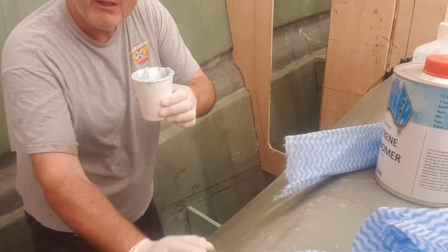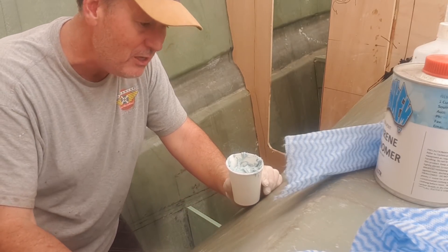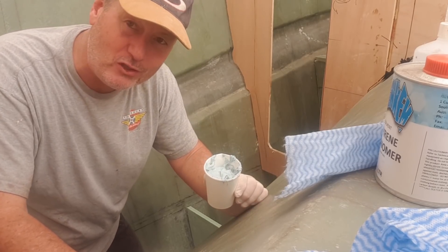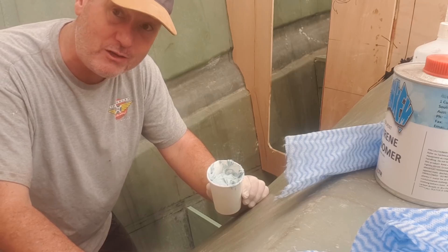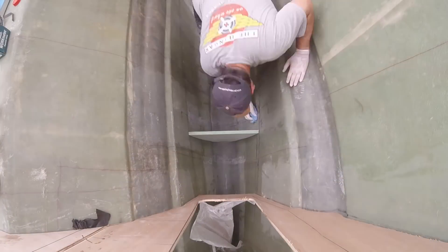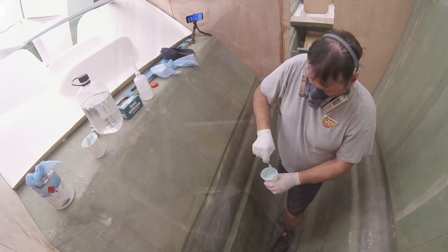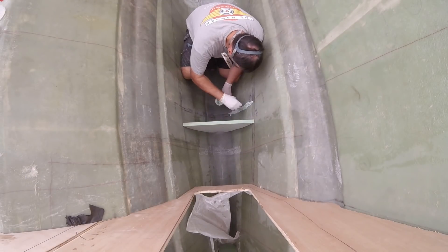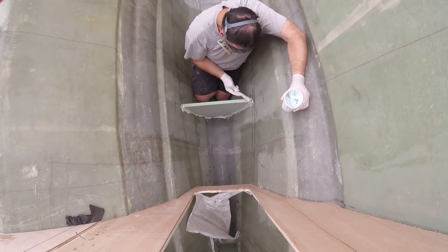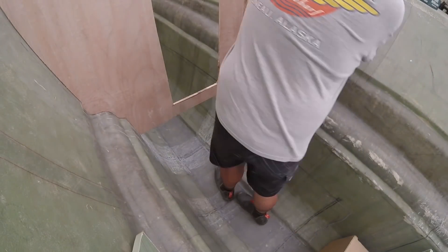I pre-mix up the filler — the adhesive, which is the ProBond light. It's brilliant stuff to work with; the issue is you've got about 10 minutes of working time, so you've got to get into it and clean it up as quick as possible. The beauty is it sands quite well — like a fairing paste — so as long as you get in and sand it within a couple of hours of laying it, you've got a good surface to work with. I have to say, it's been one of the more rewarding parts of this build — putting these bulkheads in — because it actually determines the structure of the boat. It's something physical you can see. Even though I'd cut them and put them in place before, it's nothing like having them physically adhered in place. I've still got to do the starboard side, and I'll put a fast-motion version of that in the next video.